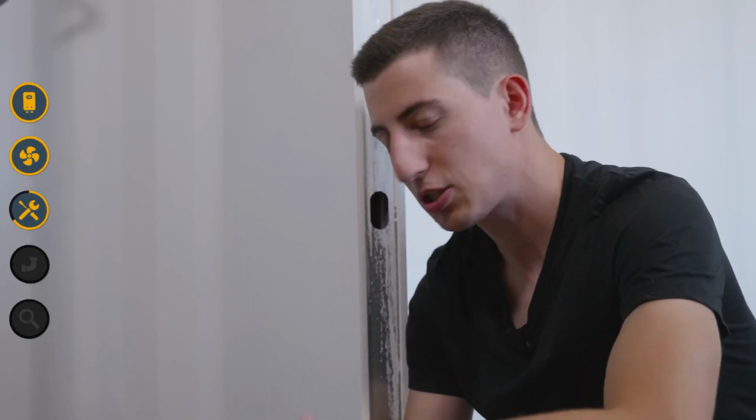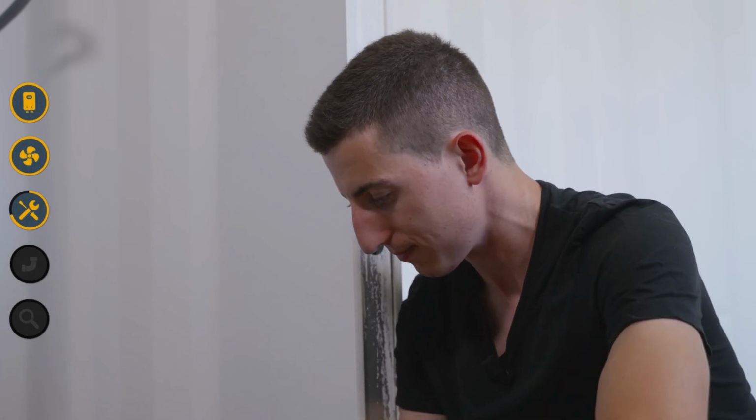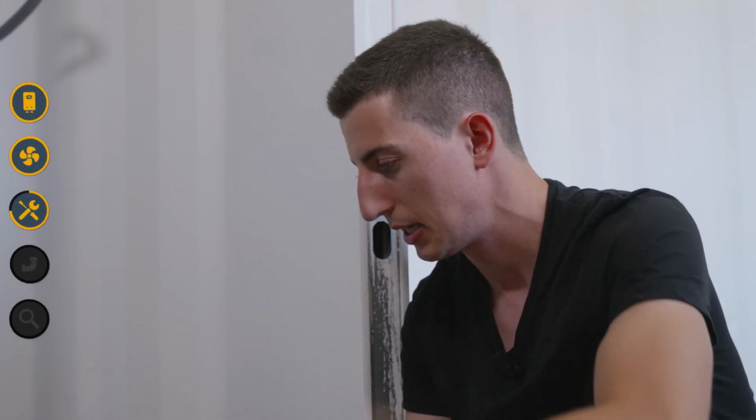Why? Because I have a thermodynamic water heater where I can set the temperature to 50 degrees. I'm not going to use it every day. I live alone, so I'm not going to waste a lot of water. So it wasn't economically worthwhile for me to install one. If you have an electric or solar water heater set to 80 degrees and lose 4 or 5 liters of water each time, it's economically beneficial to install an expansion tank.